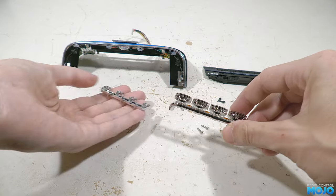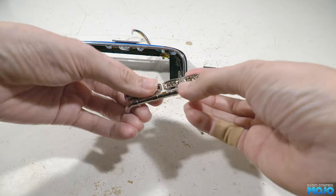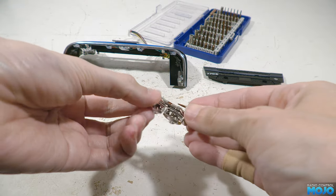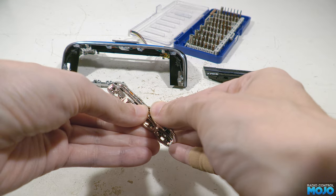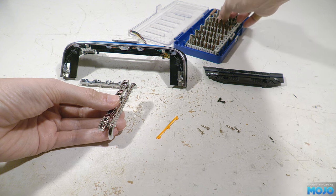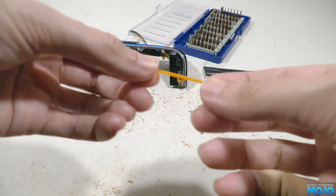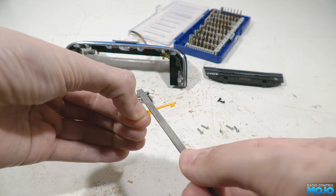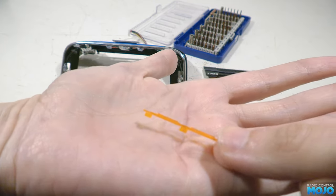The bar has two sets of lights — the spotlights and the three little orange lights, so we'll do them first. When we built the kit we pressed in an orange lens into the back of the bar, which we need to remove. A very small hex bit works quite well — just gently push the lens from the front. I'm going to glue some surface mount LEDs onto the back of the lens, so we need some flat areas for them to attach to. I'm going to file some flats, being very careful not to go too far — one directly behind each of the rectangular bits.